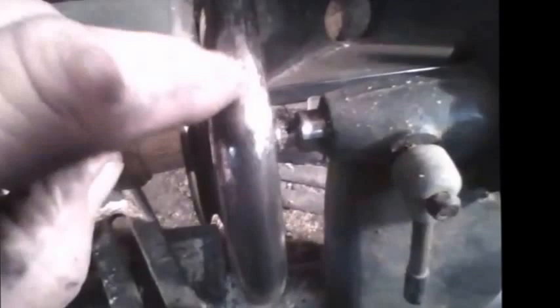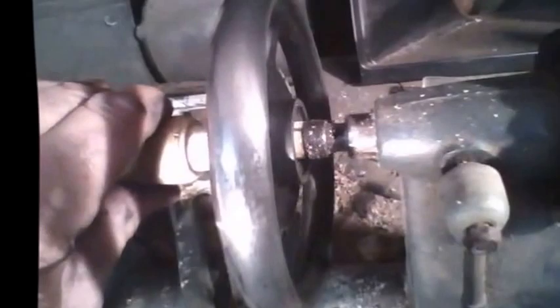Let's see what we've got. Look at that real close — let me get this with the light on it. What we've got is dark and light spots. It does look better, I will agree, than what it did look like. Right here where we did have plating left, it polished it and smoothed it off. But if I rub my fingernail across it I can start peeling off the plating that was already damaged. We haven't fixed anything. What we've done is smeared some aluminum over what was there. We have made it look somewhat better — I agree. But we have not fixed anything.